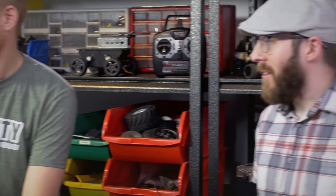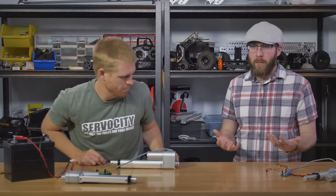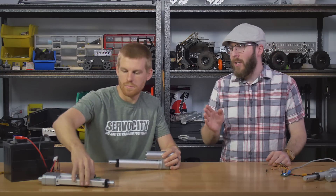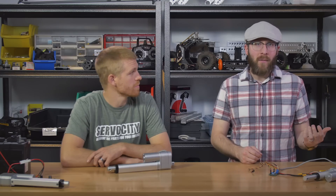For you visual learners, I'm going to dissect one of these linear actuators so we can see the inner workings. While he does that, I'll touch on some differences to summarize between linear actuators and linear servos. Linear actuators have probably the simplest setup option — at minimum, all you need is a battery, and you can change direction by changing the polarity of the red and black wires. On a linear servo, you don't want to change the polarity of the red and black wires — polarity is important. On a linear servo, if you're going to take a PWM signal to control the position, that's a much simpler setup. It can be done with a linear actuator too, but it's more complicated because you need an external motor controller, whereas the linear servo has a built-in motor controller. If you're doing a project with a microcontroller, this might be a really nice way to go because you can read that pot value as an analog input into your project, and your program can know where it is within the stroke.